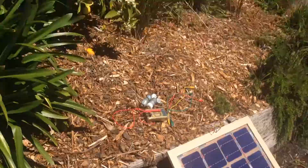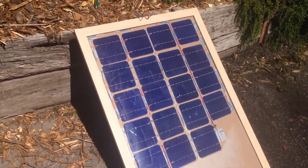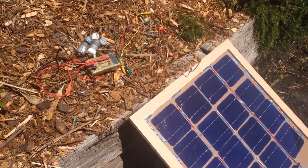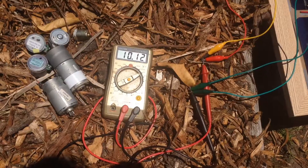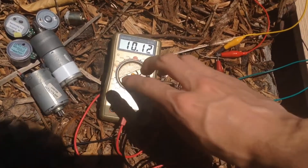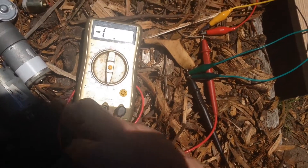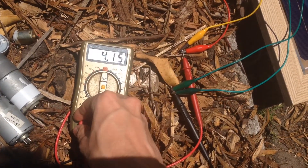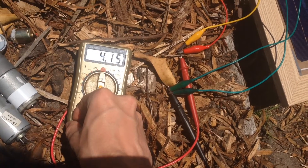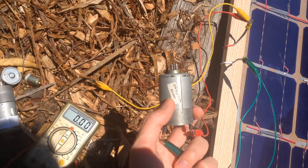Alright, it's the next day. The sun is shining very brightly now — it's the perfect conditions for testing the solar panel. So we'll connect up the multimeter and see what kind of current and voltage readings we can get off it. We've got a little bit over 10 volts open circuit voltage, and short circuit current — we have over 4 amps — so that's pretty alright. Just like before it'll run a drill motor really easily.